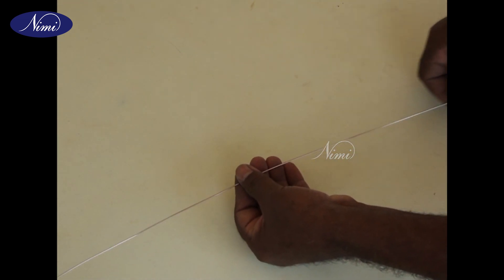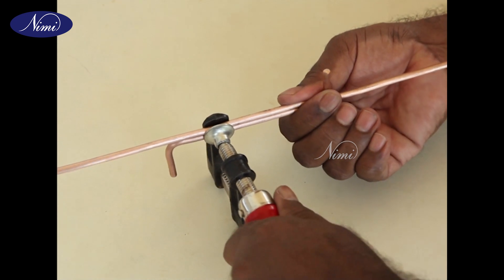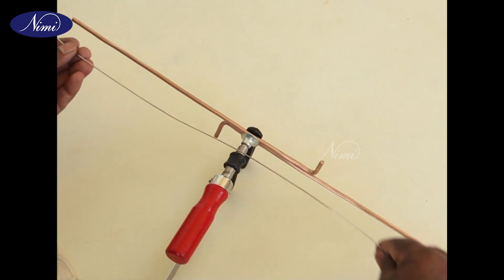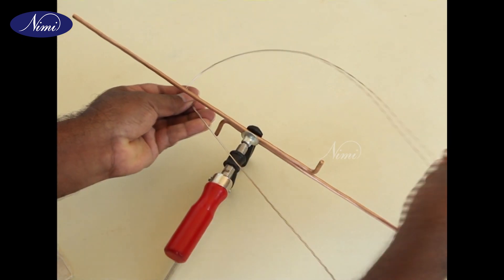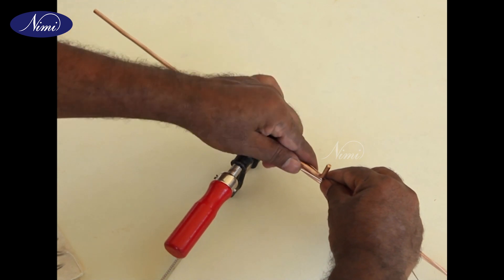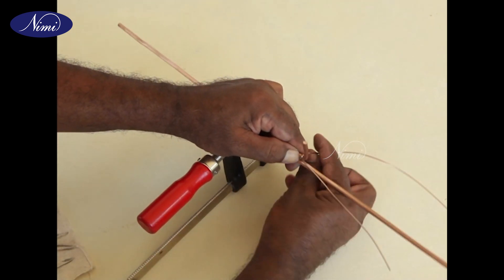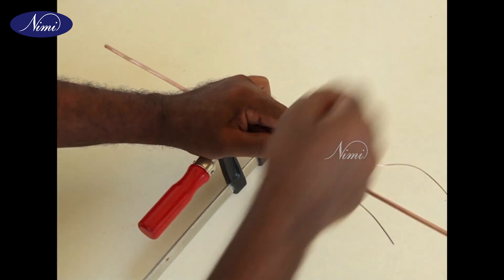Clean both conductors without any nicks. Step 5: Hold the two ends of the bare copper wire to be joined in the hand vise. Step 6: Form a loop of binding wire leaving one end about 250 millimeters at the right hand side of the joint. Place the binding wire in the groove formed in between the main conductors. Step 7: Start binding the wire tightly over the joint from position A and continue till position B.